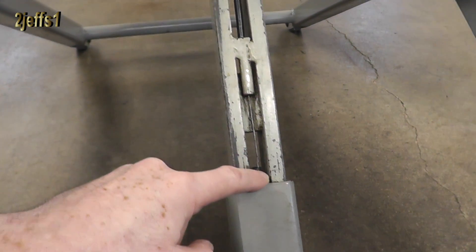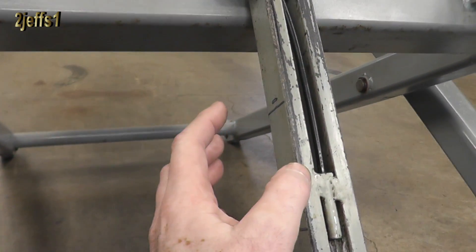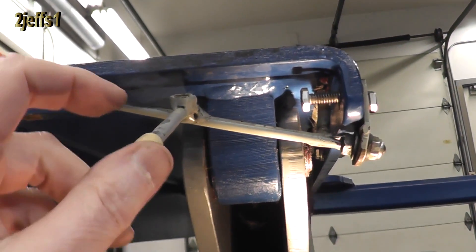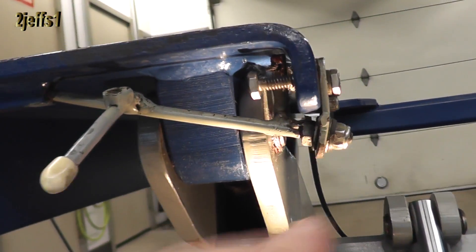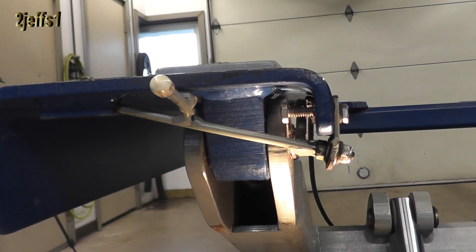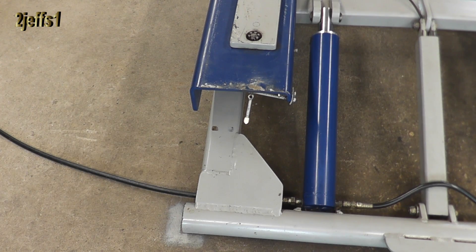That safety lock finger is inside here — you can see where the cable is hooked to it. I welded a little biscuit on here to hold the cable, so you can release it from any position you want. I had some old cable left over from the go-kart days, which came in handy. Here is the homemade release mechanism. I also have a rubber stop right here which keeps tension on it when you lower the hoist — it hits here and automatically resets it for the next time up, so you don't have to worry about forgetting to lock it.